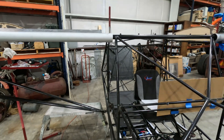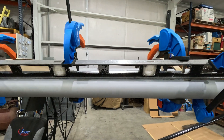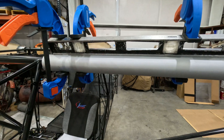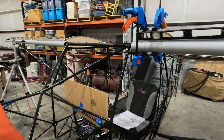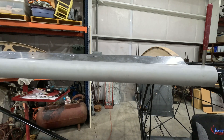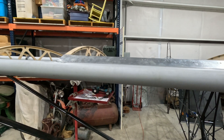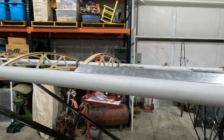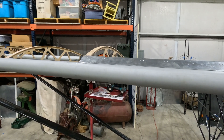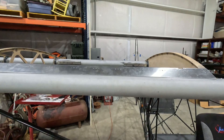I found out that I was having a little bit of trouble trying to put the nut plates down the ribs — trying to get the rivets to go in because I was drilling the hole through the wood exactly the same size as the rivet itself. What I found out was that some of the nut plates have a very slight burr in the hole and it won't let the rivet go through. I fought that for quite some time before I figured it out — I thought they were all perfectly the same size. That little burr on the inside of a few of them made all the difference in the world.